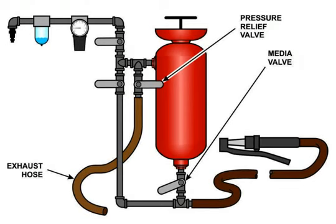If you are using a cabinet, the simplest way to do this is to use a length of garden hose, exhausting it directly back into the cabinet. When using a valve, always open it slowly and remember to close it as soon as your pot has depressurized.